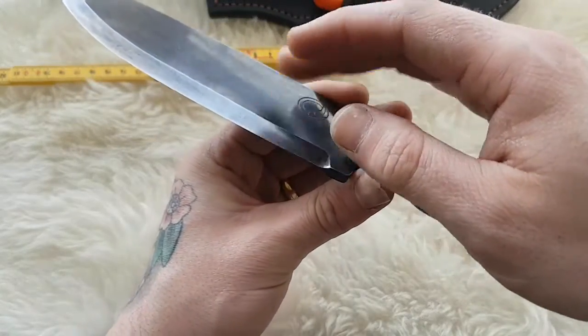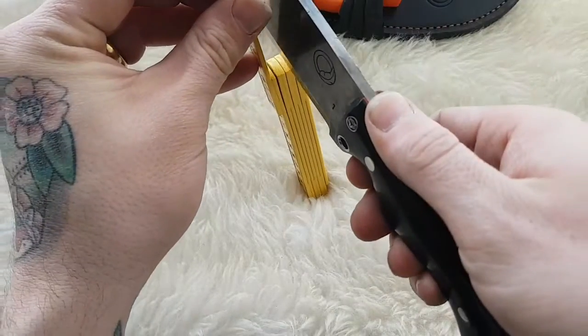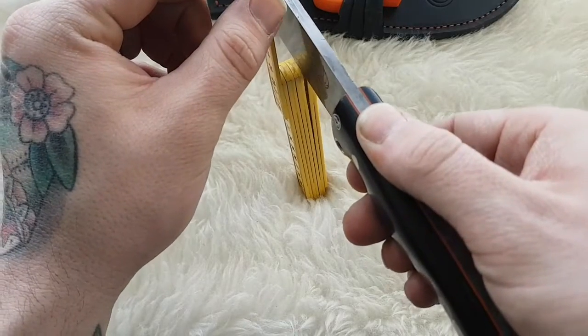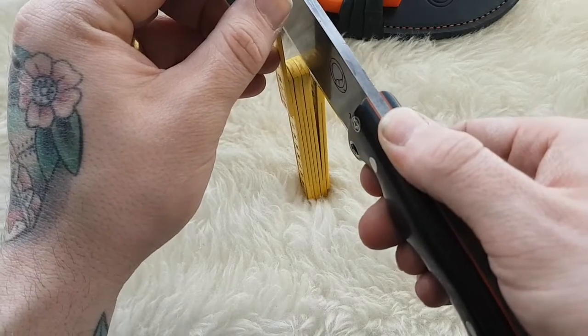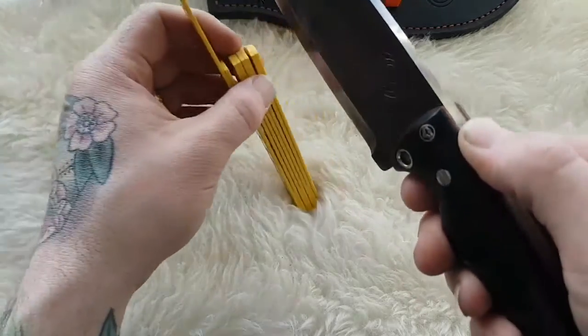So the 12.5 degree low shoulder grind allows the baton, again we can try using my ruler, that when your edge goes through it you can see instantly there that my edge is only in contact for at least one strike of the baton. Not 2 or 3 strikes to get the shoulder in, just one strike.